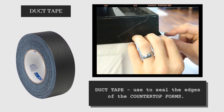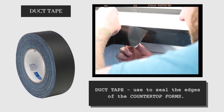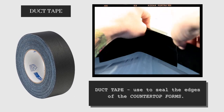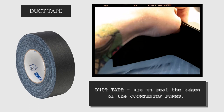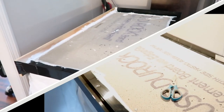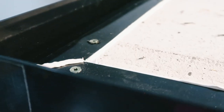To make sure your corners are sharp and clean, you want to use a very sticky duct tape. Take some time here — you want to make sure these corners are good because how it sets up is exactly how it's going to look when it's formed; it will not change much. It looks messy, but there's the durarock, the caulk, the screws, the duct tape, and the plastic underneath.